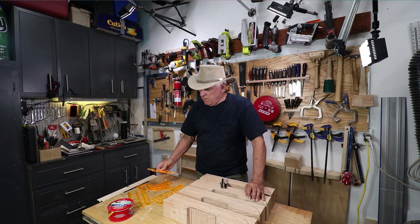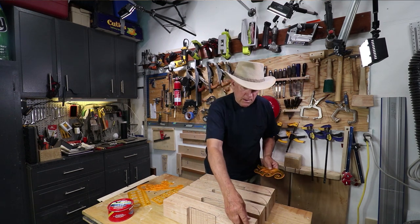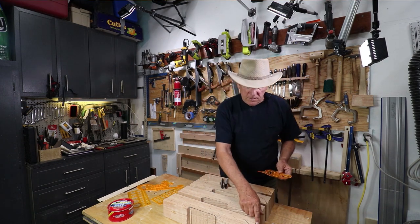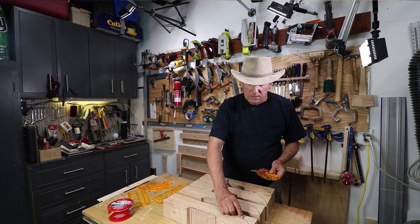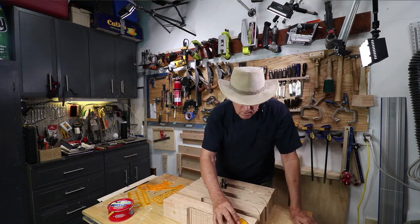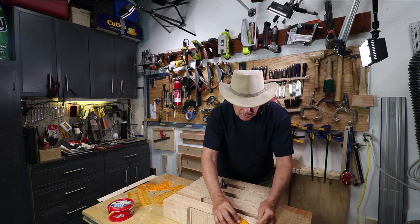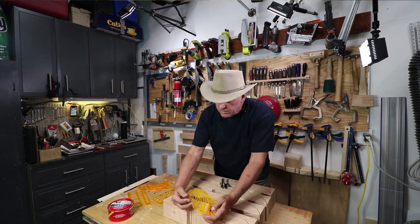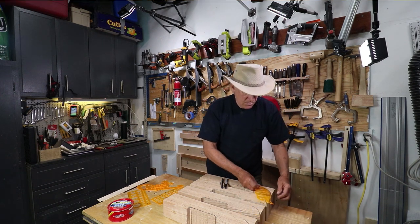What I'm doing now is picking a curve that I want for the design. There's going to be a double curve — one here and then another one here. I knew the measurements I wanted: this is up two and a half, over two. So I used an awl to put a little dot there, then tried different ones and finally found the shape I wanted. On the first one I marked on the template right where it's going to meet the edge, and then where it meets the mark. That way, with those marked, I can get exactly the same shape, which is what I'm after.